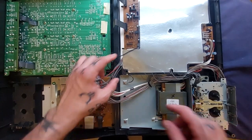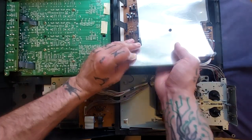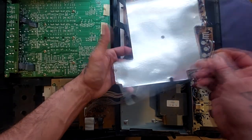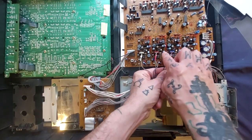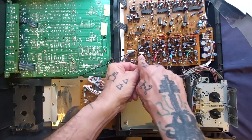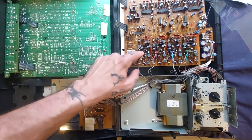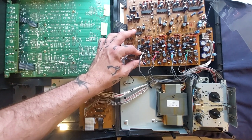I probably should have shown the detachment of the magnetic heads from the record/playback board first. Underneath the shielding, it looks like it's just going to lift off — there's a plastic covering, presumably so nothing on the board shorts against the shield when it's shut. Let that dangle to the side. We've got four headers where the heads terminate; it looks like the erase and record heads share a header each, with five pins on them. There are annotations saying track one, track two, track three, track four. Yamaha's colour code is white, red, blue, green for tracks one through four — in contrast to Tascam where brown is one, red is two, orange is three, and yellow is four.